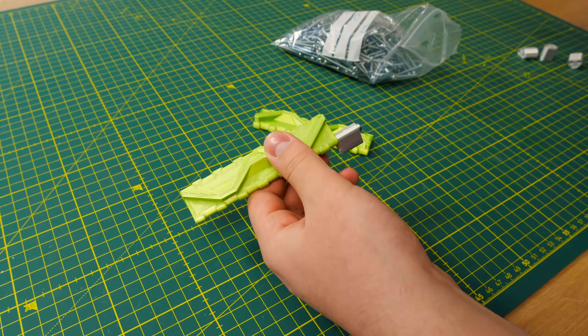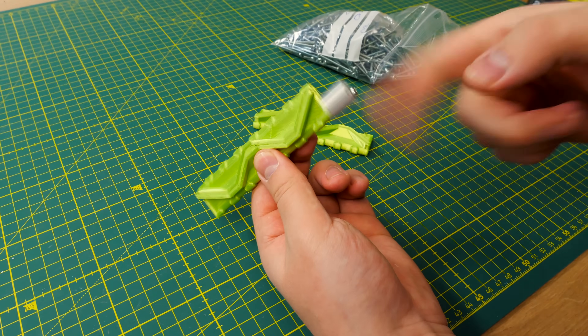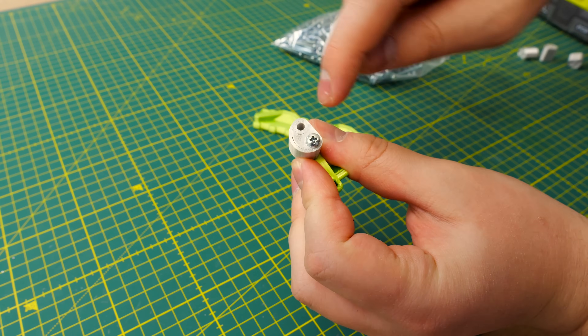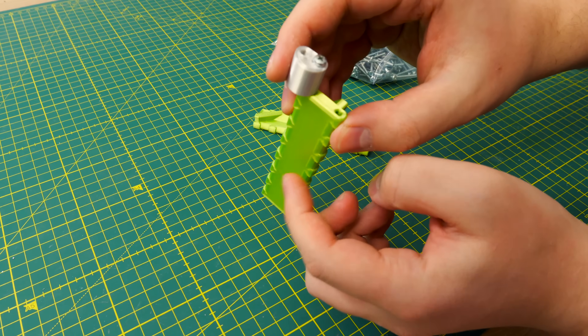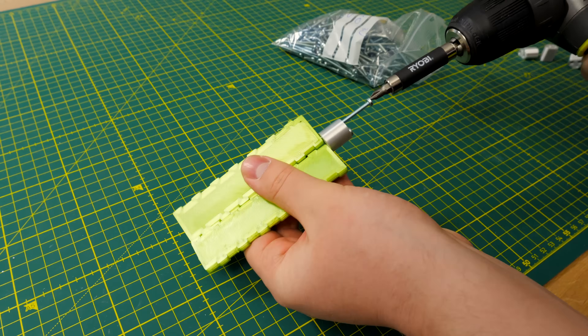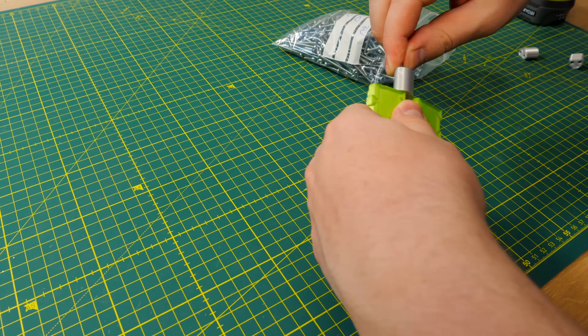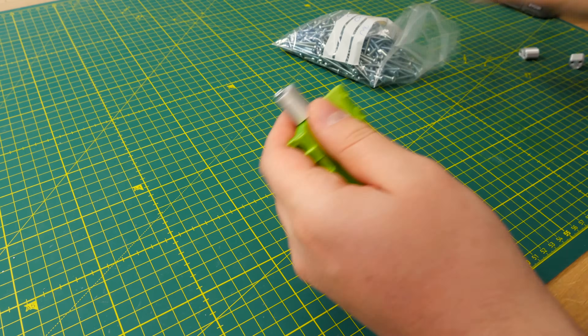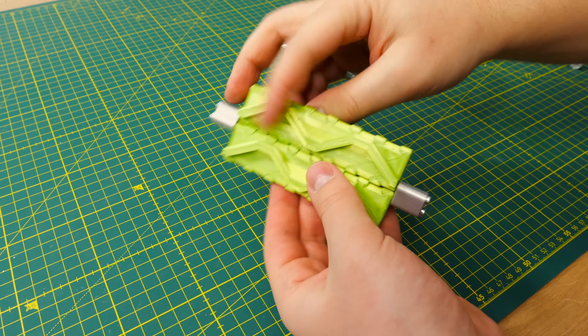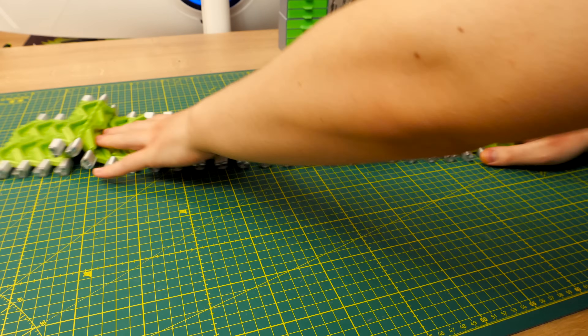Two things to keep in mind: this bolt has to be screwed in as much as possible, but the outer link has to spin freely. And the outer link flat side has to face outside of the track, and the round side has to face inside. By the way, this direction is really important. This is how it should look and work — but this is only one link. The whole track should look like this.